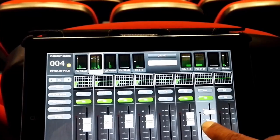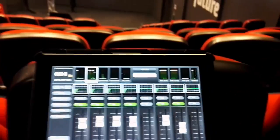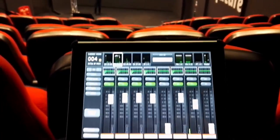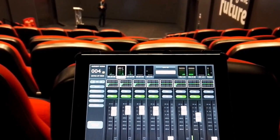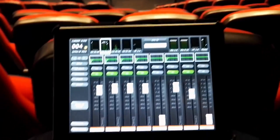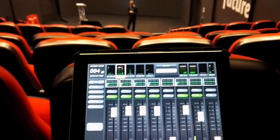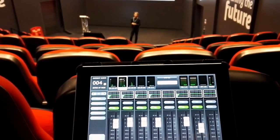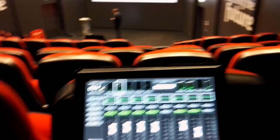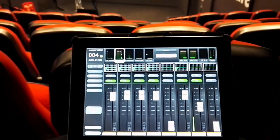This is AKG? Okay. If you switch it off and turn it back on, it will show you the input gain. Is it set to 0 or is it higher? It's plus 20, right? Okay, that's fine. I'll adjust that from the receiver, because that's the only way. You can't adjust it from the transmitter. So leave this on at the moment and put it beside lapel 2, please.